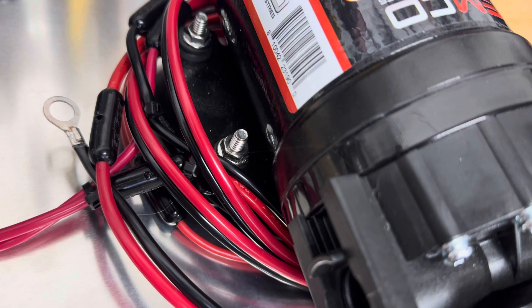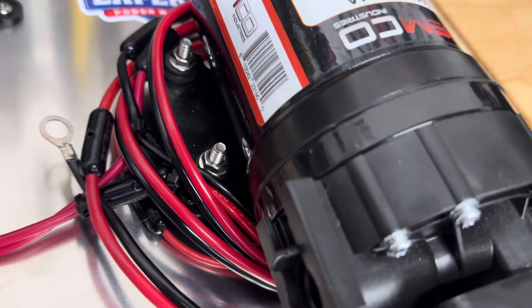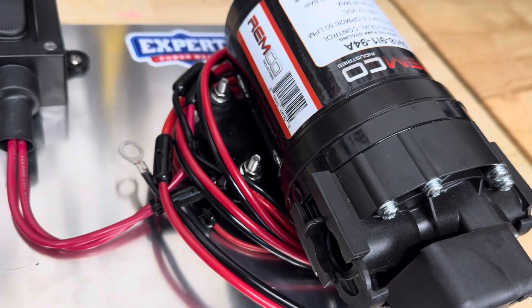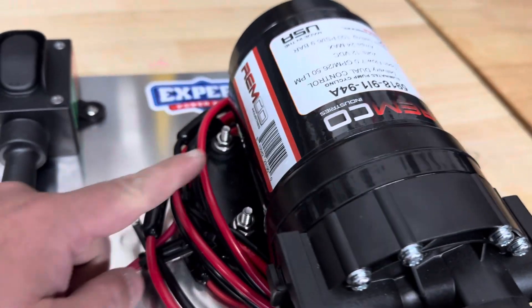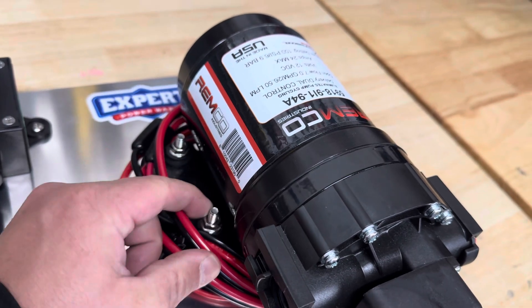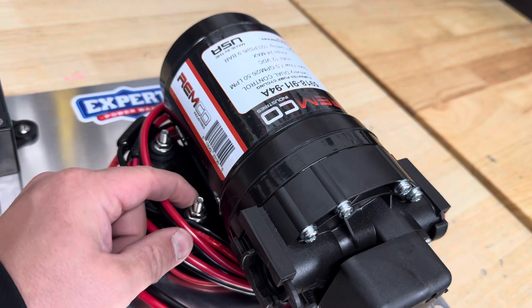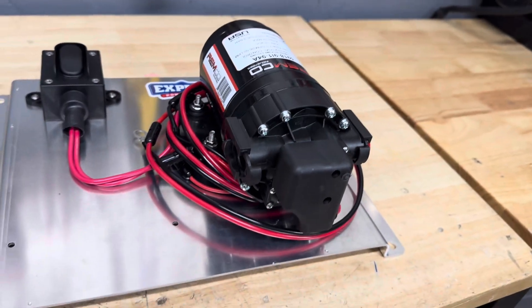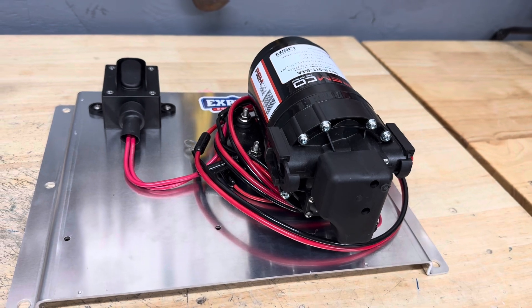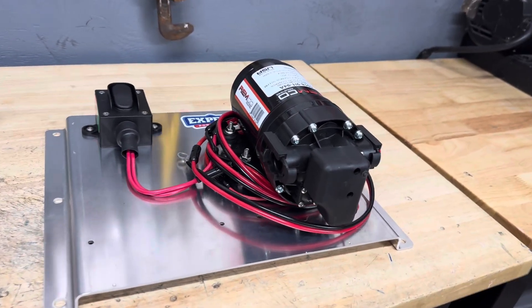Another thing that we're doing here is we're using flange nuts instead of the nylon lock nuts. We were finding that the nylon nuts were taking a long time to get these off. Once you get it loosened up beyond the pressure that the rubber's up against it, these come off real easy. So you can really swap one of these out in less than five minutes — that's just going to help you be more efficient out in the field.